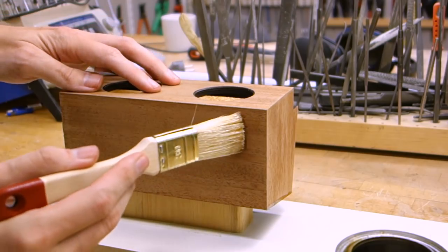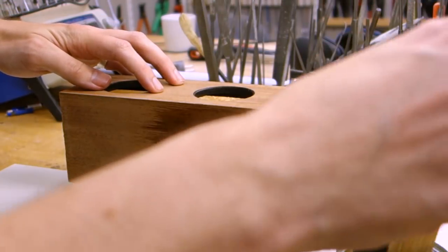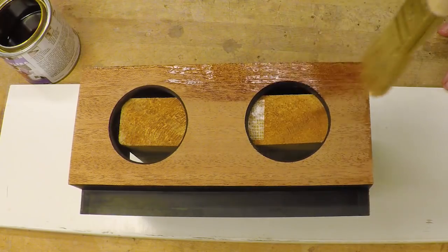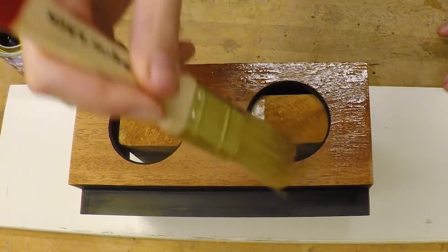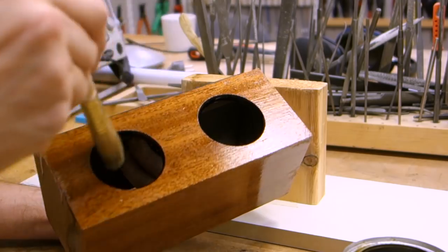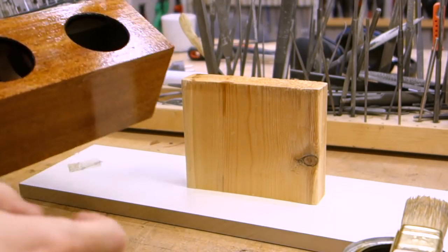The varnishing immediately did not feel right. I applied a polyurethane varnish like I have on many projects before, but the veneer did not like the varnish. It doesn't show up well in the video, but it started beading up on the surface of the walnut veneer. In some places it absorbed and spread out fine, on others it was almost like mixing oil and water. At this point I felt dejected, and all I wanted to do was just throw the whole thing against the wall.